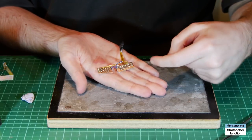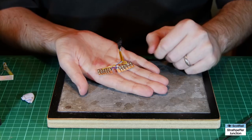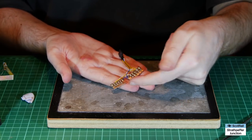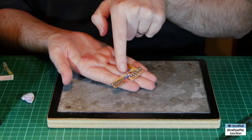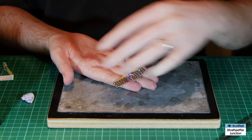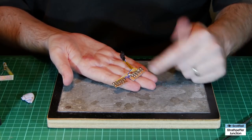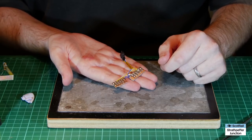Right, so that's all the soldering of the jumpers and the socket all completed now. If I was to do this again, I would make this all one single board and I would line up the different lights next to each other so we didn't need to have these jumpers going across. The reason, as I say, that it's ended up like this is because I thought I'd have to have them as two separate ones at either side, at either end of the body. But anyway, you live and learn. Next time I know to refine it, if there is a next time for the Lima 47.